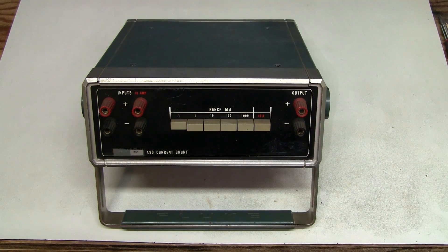They are made by Fluke, so they are designed to be quite stable in terms of aging and temperature drift. They are packaged into this case with quality binding posts, with 4-wire connection or so-called Kelvin connection. This might be very handy as a reference — not a resistance standard grade reference, not a calibration lab grade equipment, but for hobby level metrology it should be good enough.